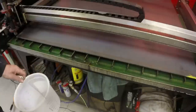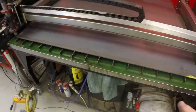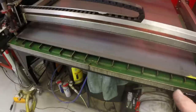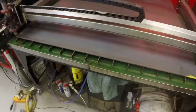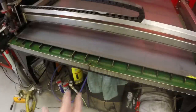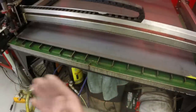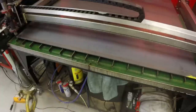The table was filled with a 5% solution of plasma green 1050, which is an additive which prevents corrosion, rusting, and biologic growth like mold or mildew in the water. And it doesn't deplete. Water evaporates, but it leaves that component behind. So all you really need to do is add makeup water.